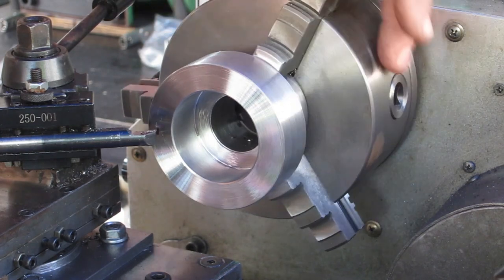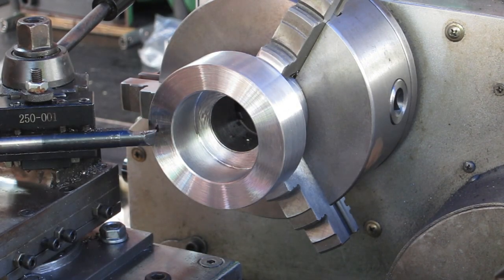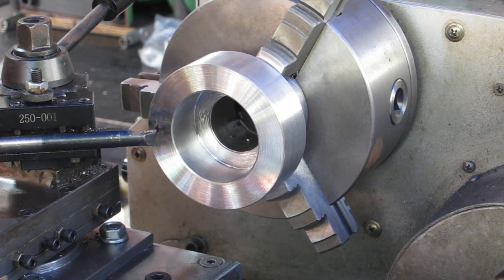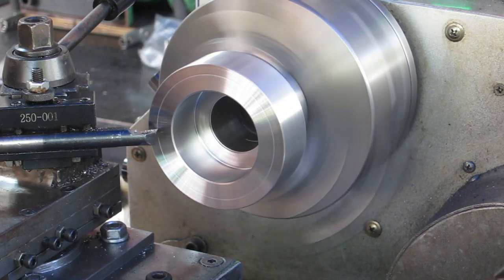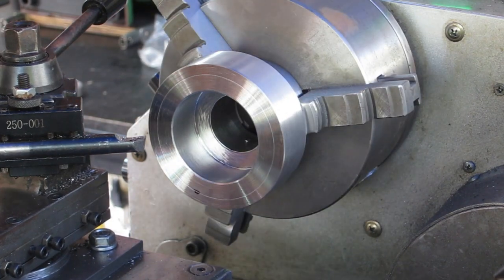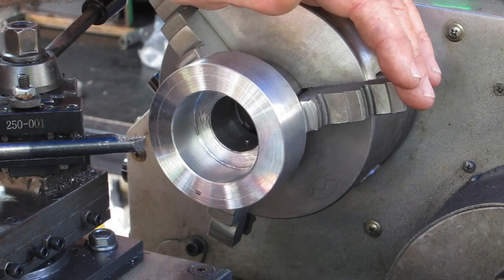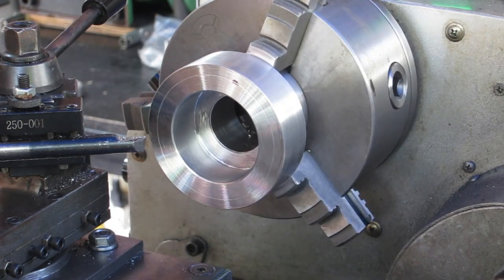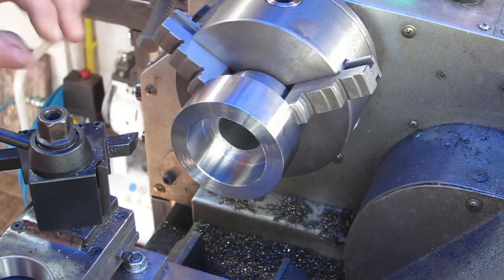Now I want to mark the face with a small ring because I want to drill six holes in here to bolt it on with. That gives me my circumference line to mark out. I won't bother videoing the second one today because it'll be — to use a bit of Aussie slang — same but different day. The next thing I'll video will be the shaft, but before I make that I'm going to modify the housing, which will shorten the shaft and make life easier for me.